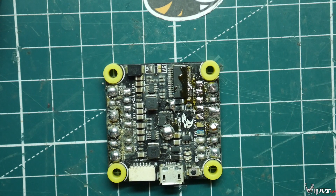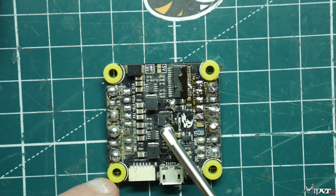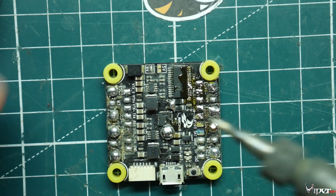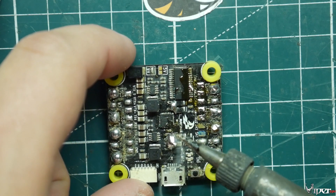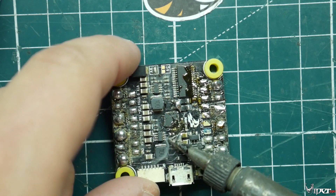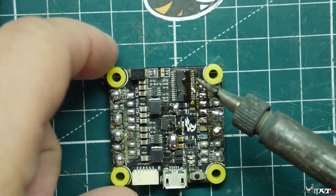So what you'll probably want first: when you have a big giant blob like that, most of the time you can go ahead and use your soldering iron — like I'm going to do right here. Most of the time you can just use the heat from your soldering iron, make sure it's clear of solder, and kind of draw it out. Sometimes you can't because there's just so much solder.